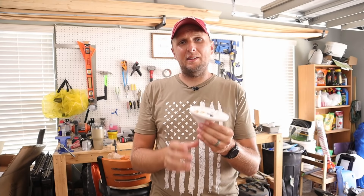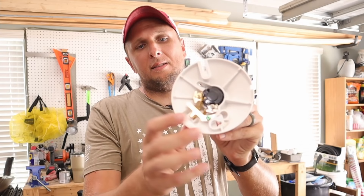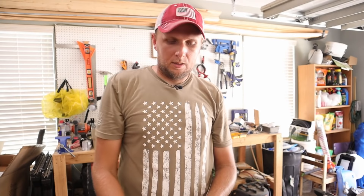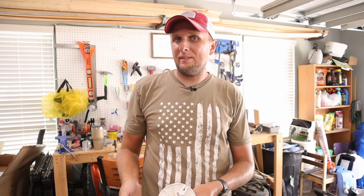Now that those windows are cut out, I can start wiring up the light fixture. This is a standard lamp fixture with a plug-in on it, and the reason I went with this one is so that when I mount the fan inside I can just plug it into this — rather than having to lop off the plug and wire it into the terminals. It also has a ground screw, and the appliance wiring I bought has a green wire for ground, black for hot, and white for neutral, making the whole thing grounded, which is always the best way to do it.